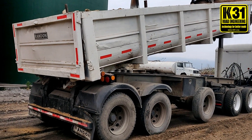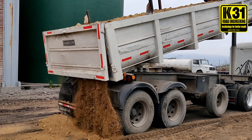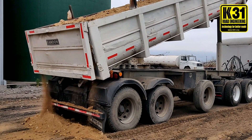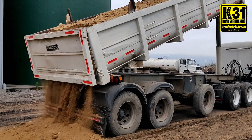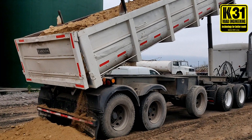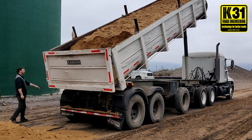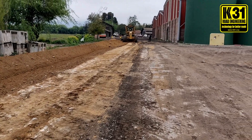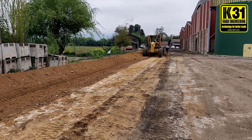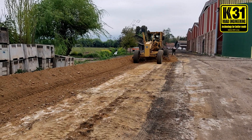This particular portion of the road needed to have the level raised in order to get proper water drainage, and the soil in that area wasn't that great. So we brought in some laterite — low plasticity laterite, maybe about 10-12 percent, which is the ideal soil to be working with when you're stabilizing. You spread out the soil and then incorporate it with the existing soil, folding it in with the blade of the grader.